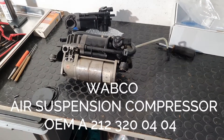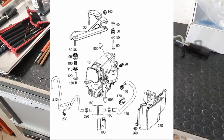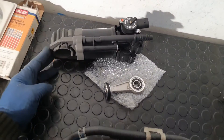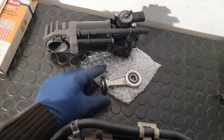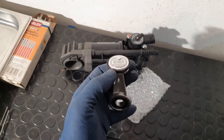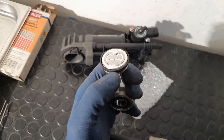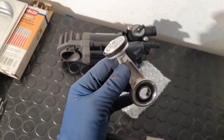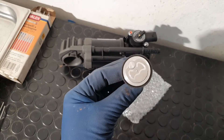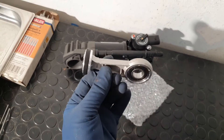Let's have a look together at how you can attempt the overhauling of your air compressor at home without paying the full price for a new unit. I was able to find some spare parts on the market — this is a piston. On the older models you can find kits on eBay that provide the external ring, this black hard plastic part that very commonly fails. Unfortunately in this case you cannot change only that component — you need to provide yourself with an entire new piston.